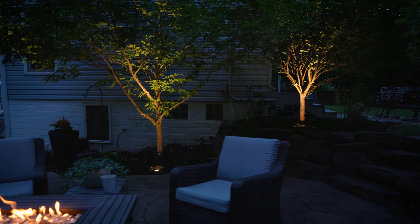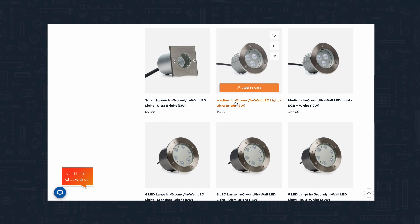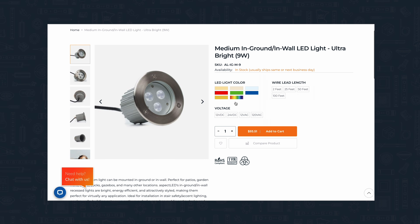For this project we want to light up some smaller bushes and trees. We don't have an existing system with a power supply, so we're going to have to start from scratch. We also don't need dimming capabilities — just a simple on/off works for us, and no need for a timer. When starting a project fresh like this, you especially need to plan it out thoroughly using a map or diagram to plot out the locations of your lights and where the wiring will go. We're going to use 3000K warm white light to give it a nice warm ambient glow at night, choosing the ultra bright variant of our medium in-ground lights.